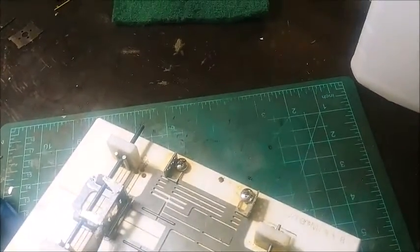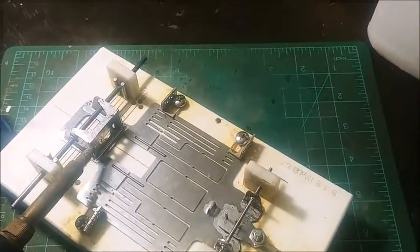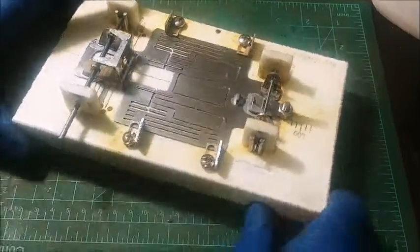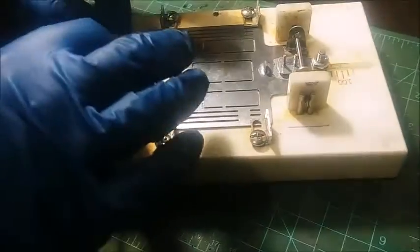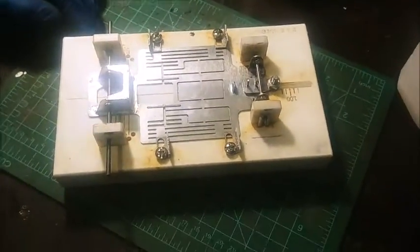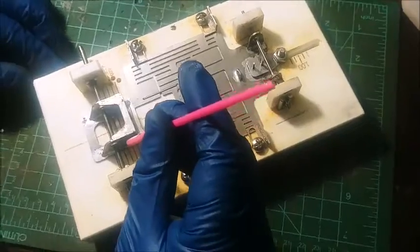So, just going ahead and getting good solder flow in all the joints. All right. So I did not do the bushing. So I'm going to go ahead and go back and verify, make sure that my jig wheels, my blocks, my 950 blocks that set my elevation for my axle, did not move at all. Okay. And they all look good. And go ahead and get some acid flux on those bushings.